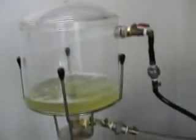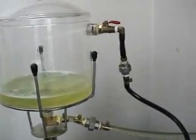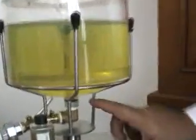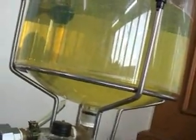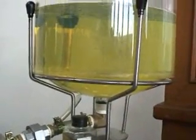This particular chamber represents the fuel going to the engine compartment, and it's pure diesel fuel, no water at all, because it's been removed by the filter. You can see there is still water here, because this is the tank part. Here there are water bubbles, representing the condensation in the tank, and this will still be collected slowly.